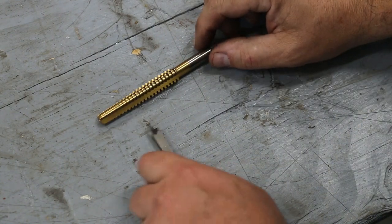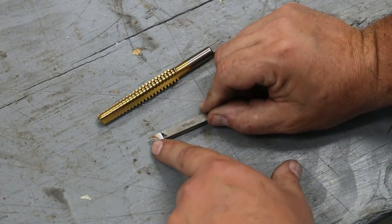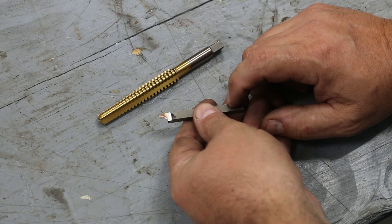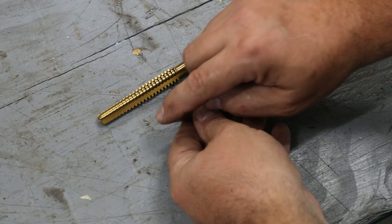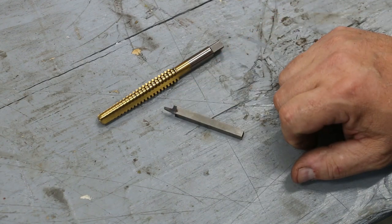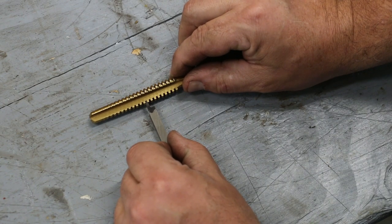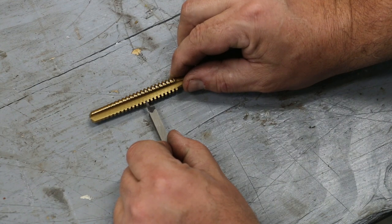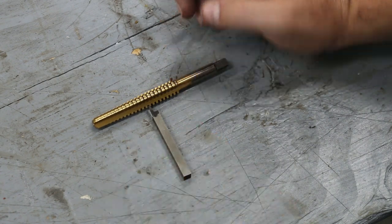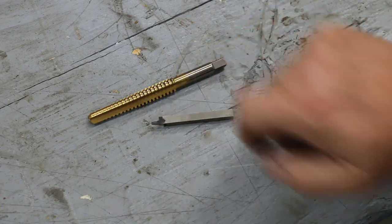Let's see what we've got: there's our profile — five degrees on each side, ten degrees total. The bottom comes down to a knife point, so I'm going to go over to the hand grinder and zip some of that off, and put a little different leading edge angle on the front. I just do that by hand and then hone it up. I tested the fit with the tap and it goes right down in there nicely. It looks just a teeny bit wide at the bottom, but I actually want that groove a little wider for clearance, so that's fine. The grind is good. After cleaning up on the hand grinder and honing, it's all sharp and ready to go.